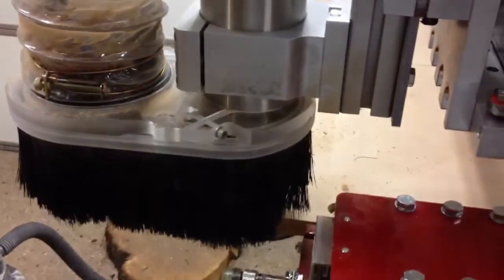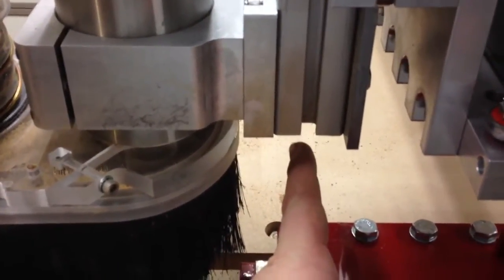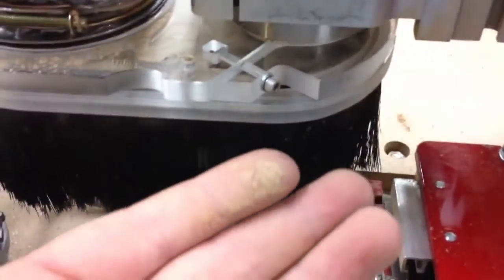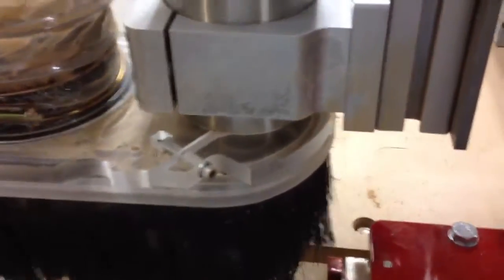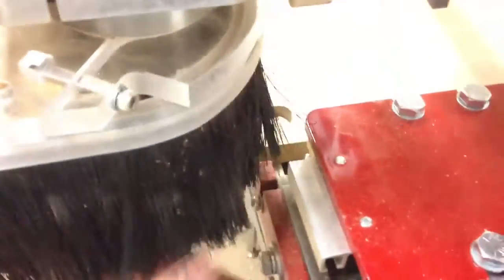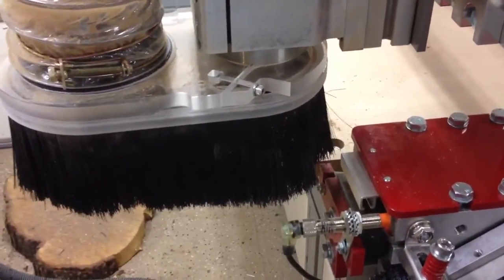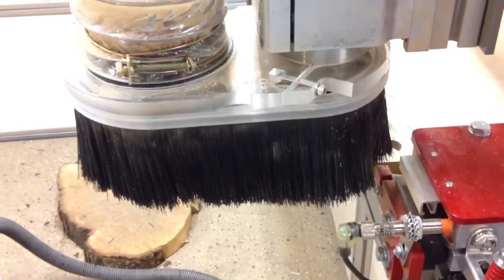I've got to see if I can get a hold of the Kent CNC people and ask them if they can make a version of their shoe that comes back maybe another inch, inch and a half. I'd be willing to pay more, because it makes a mess of everything — that fine dust gets out and gets sucked onto everything. That's not a very safe working environment. Not only that, but it can end up destroying the bristles on your brush. I was pretty disappointed. For surface planing applications, I would definitely not recommend buying this shoe — you'd be better off looking into making something on your own.